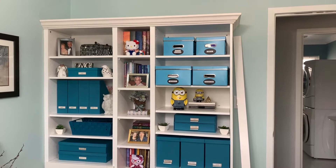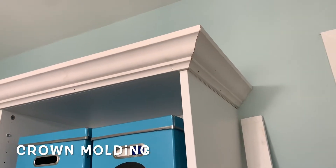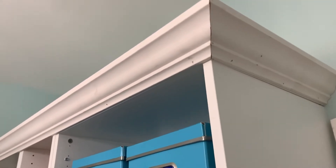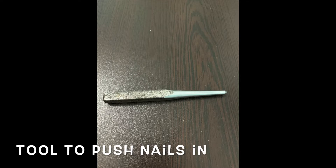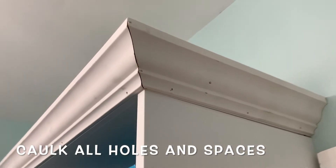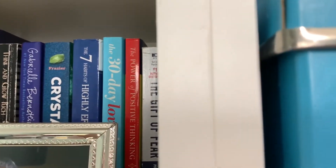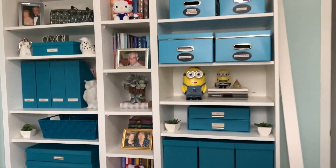Okay, it is just about done. I added the crown molding — I will not take credit for cutting that, because cutting crown molding and doing a miter edge is really hard to do, so I had someone do it. But I did nail it in, and you can see the nail holes which I will caulk. I'll also caulk that little space. It's Ikea, so you get what you pay for, but it looks well. I'm going to caulk all the seams here — I did this one already and it'll come out really nice. I'll caulk along this side all the way down so it'll be nice and smooth, and do any touch-up I have to do. As I step back, it is done.